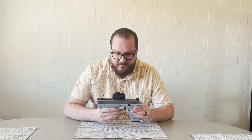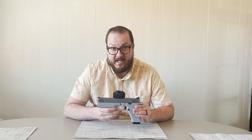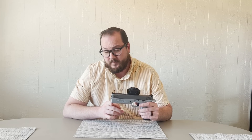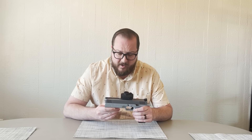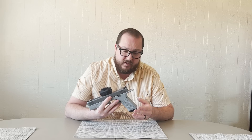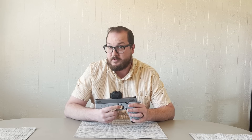It's kind of a weird design — Glock-based, which is not my normal forte. But lately I've kind of been in love with the Glock 17L, the long slide and long barrel design, and decided to make an even more ridiculous frame than my last one, the Glock 17LB, the long boy. This is relatively similar to that concept where you have a smooth dust cover with no rail that comes up flush to the barrel and slide. Where this one differs from the last one — the Glock 17 long boy has a 19-length grip and is designed around the PY-2A architecture and rail design. This is designed as a remix of Ivan's DD 17.2 frame design, and in this particular build utilizes riptide rails, which I really like. We'll talk about that a little bit later in this video.